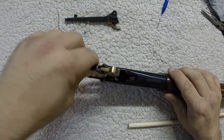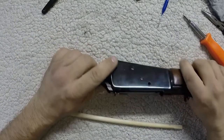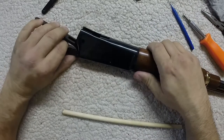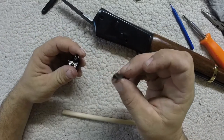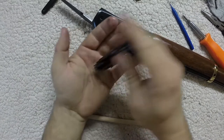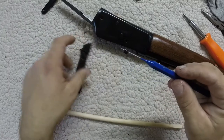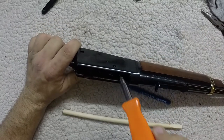Right there, we got that. That's why this little wire right in here is important. At this point the bolt should be able to come out now. As you pull the bolt out, there are some little pieces on the front of it that can come off, so watch that — they're going to be right up in here. Just kind of slide it. There's this spring right there, and then there should be a little piece — there it is right there. That's an annoying little thing to hang on to. Let's put that in our cup.